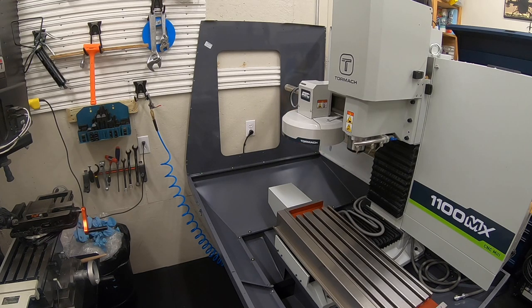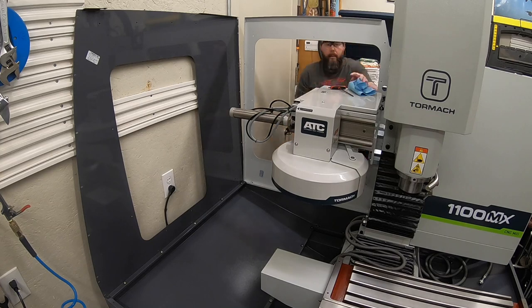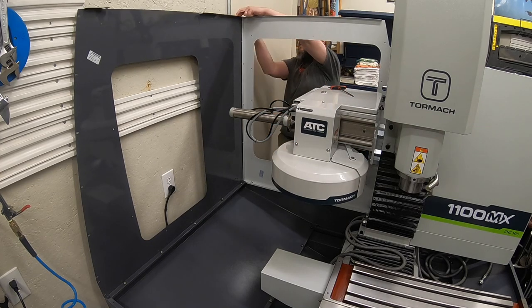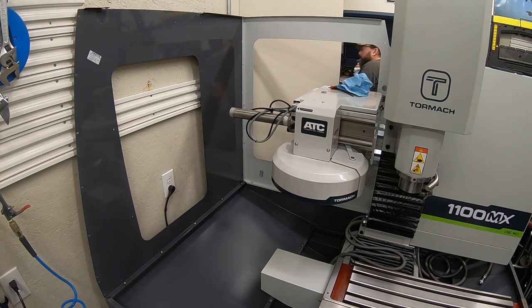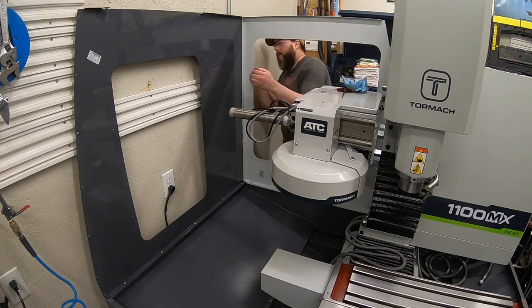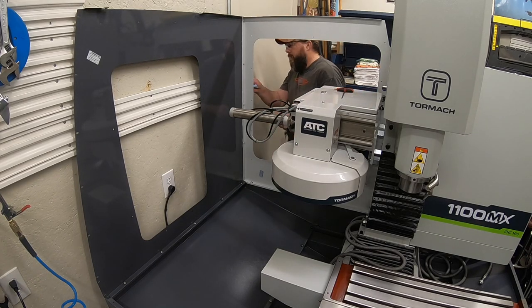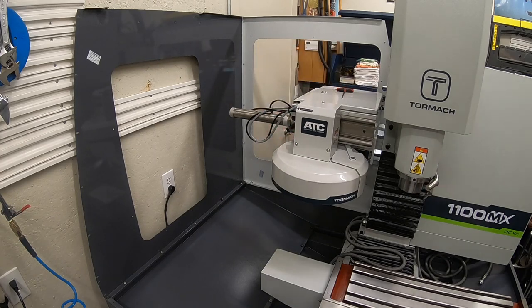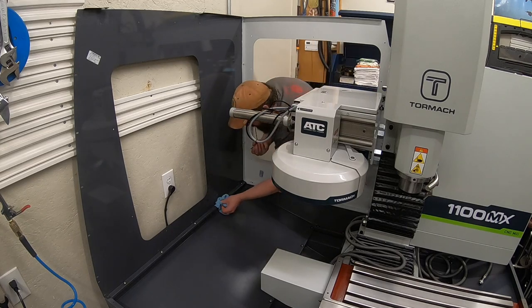And since later on I found one of these bolts that was a 5mm instead of a 6mm, I'm guessing that one is probably 5mm as well if I went and tried to put one in there. Eventually, I ground the end of that 6mm bolt to a point to try to get it to start. And finally, I found an 8x32 screw with a nut, and that's what I ended up putting in that hole since I just could not get that 6mm bolt to go in there.